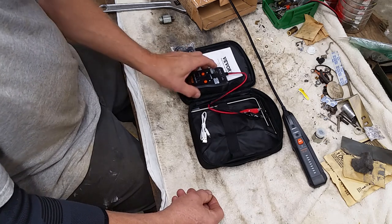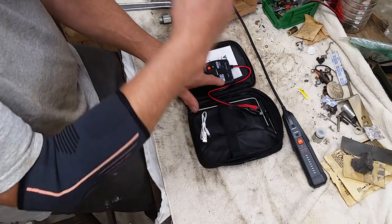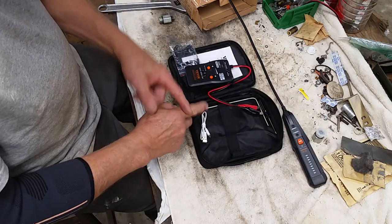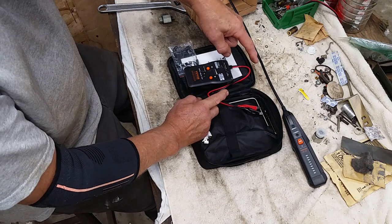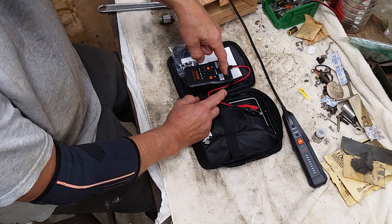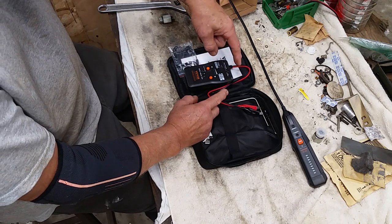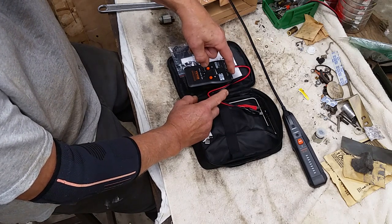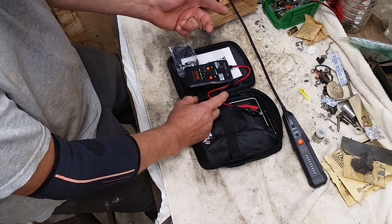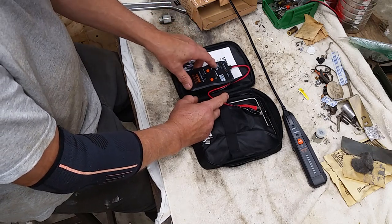And continuity works. I decided to try to see if I could tell where the break was. I ended up cutting the cable somewhere past the garage, around the corner, across the ledge. I had found the cable over here, dug back towards the garage because I felt that's where the break would be, and 10 feet away from the ledge, I cut it. Twisted the wires together, checked continuity, and I had no continuity on the red wire. So the continuity works. Didn't try the analog.